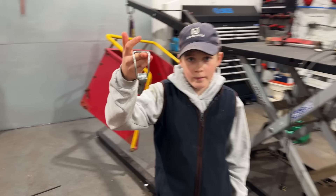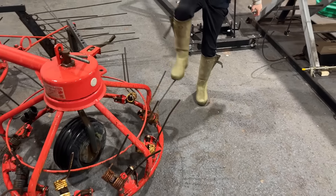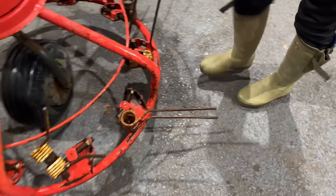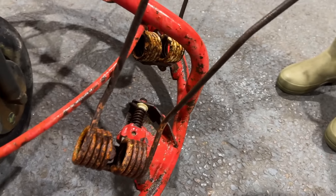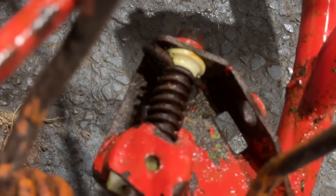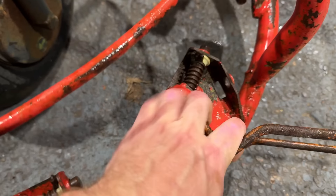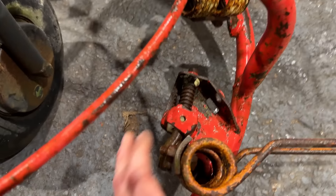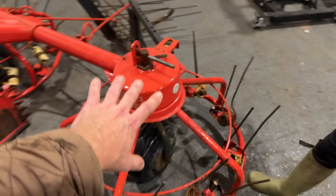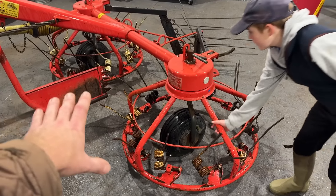The other job - fold down one of these tines. There we go - they are sticking down, but they should spring back up like that. This one isn't springing back. These are generally well greased, but they haven't been for a while, so they're just starting to seize up and not moving within their plastic bushings. We need the grease gun over there. Get them freed up with some WD first and then grease them all afterwards. The best thing about this is that all the tines are complete - every single one.